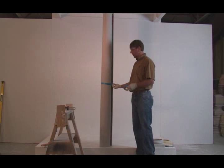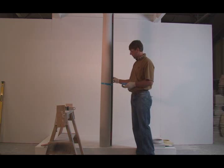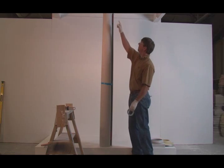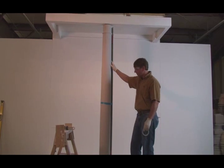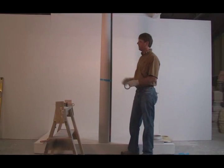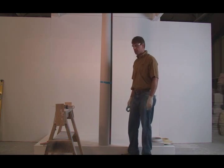I've used the blue tape that's available in the Column and Post Split Fit Kit to temporarily secure these column halves in place so they don't fall apart. We want to verify the quarter inch at the top to make sure that the load will not be transferred to the column in any way. I've also made some marks on the ground and the top to align the column so that it's nice and plumb for the final installation.